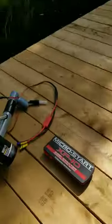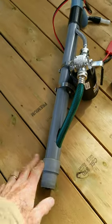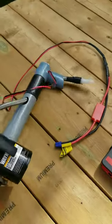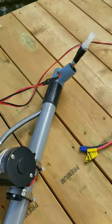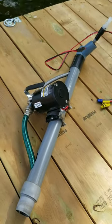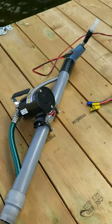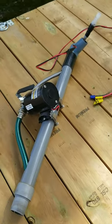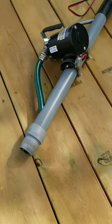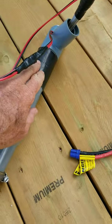The gray body of this pump is actually one of the standard marine/aviation float pumps used in boats and planes — just a manual pump that had a lever on top that you would stroke to pump it. They work well, but eventually the seals inside go and they stop working. This one was finished, so I basically cut the pump right where you can see the gorilla tape.